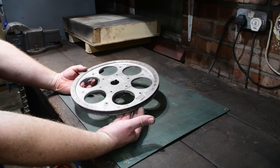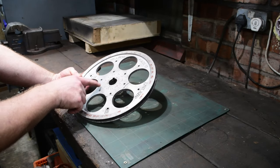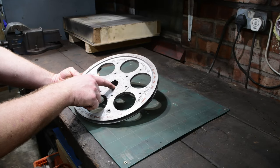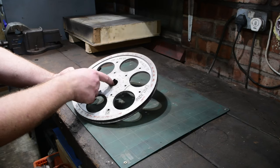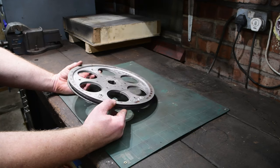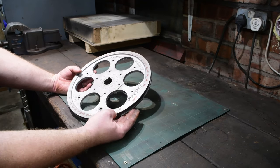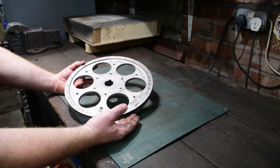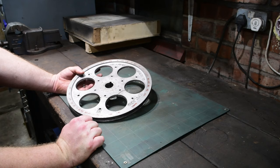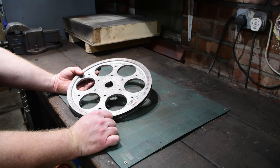The options for this are to try and repair it, however looking at it, it looks like someone's already pulled it several times. The edge where the bore goes in with the drive shaft looks like it's been welded a number of times, however that could just be part of the manufacturing process. The parts where it's cracked are obviously under a lot of stress - maybe it was a manufacturing problem for this particular pulley, or maybe something fell on it. I don't really trust it. It might be an interesting project just to see if I can do it purely as experimentation for some welding, but as to this actually going back on the machine - probably not. I'll probably replace it.